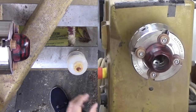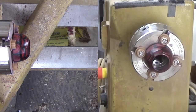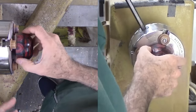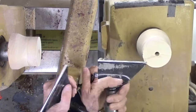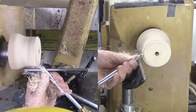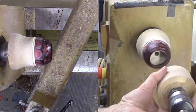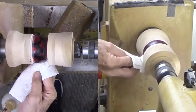The task now is to square it off and then finish the exterior. My skew does a good job scraping the thin edge to square it off. I apply shellac friction polish to the portion above the chuck nubs. Now to try to finish the remainder where the chuck nubs were in the way, I decide to use a jam chuck. I grab one of my threaded faceplates and cut it back to fit the inside of the segmented ring. Success! I'm able to sand and apply shellac here also.